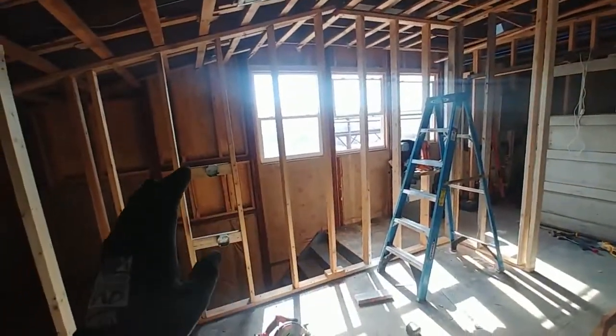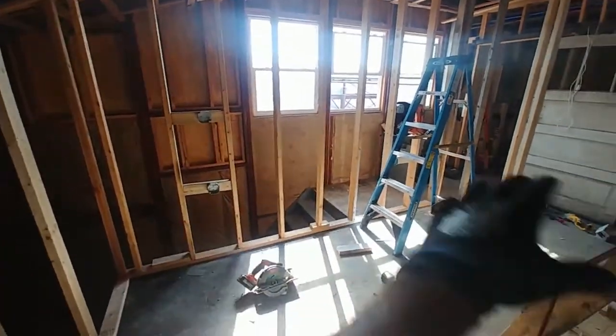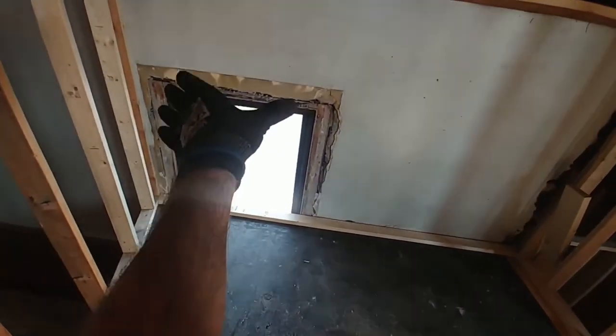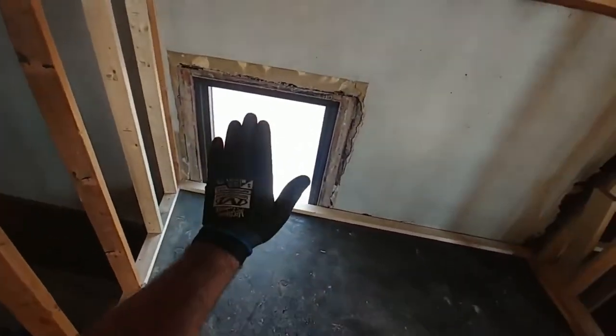All right, so they got windows out to the lofted area. They got his and hers power and his and hers sconces on either side of the bed that's like here. And on this side, there'll be a closet space. I'm going to take an angled box down from this window and notch out the floor here. So all the window light's going to go out underneath the balcony, and this will be finished off in here. And then we'll have to have a door here.